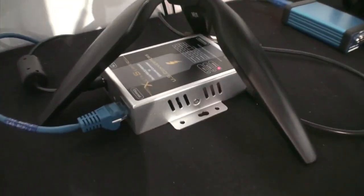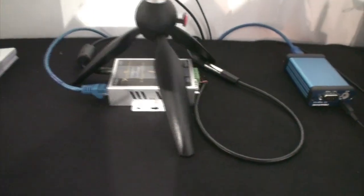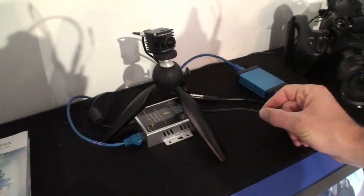If we are talking about DreamChip cameras or Marshall POV cameras, they would be managed the same way — through a converter box. Somewhere where you have these cameras hooked up, maybe you have like 30 of these cameras distributed in a building, they can be daisy chained in terms of the RS-485 signal. This box essentially converts from Ethernet commands over to RS-485 commands on this wire.